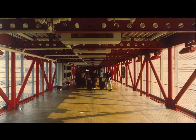Here we have a floor diaphragm, which is corrugated metal with concrete cast on top of it, with reinforcing all through the concrete. So it becomes like a deep horizontal beam. And then those two diaphragms intersect this deep vertical truss. So it's a tall enough and deep enough truss that people can actually walk through the bridge. The nice thing is that really deep truss can also span a very long distance.